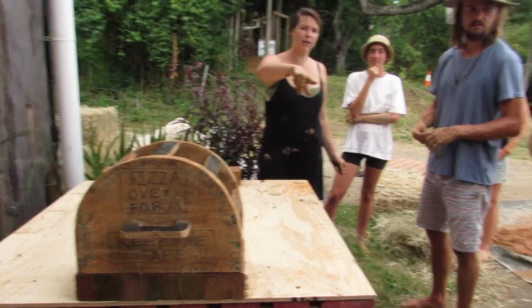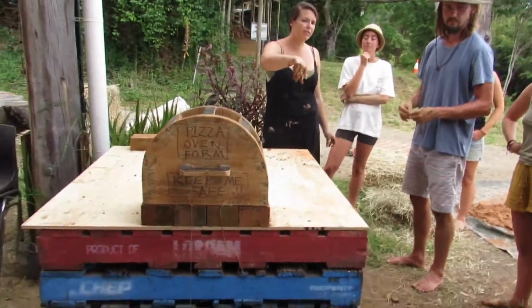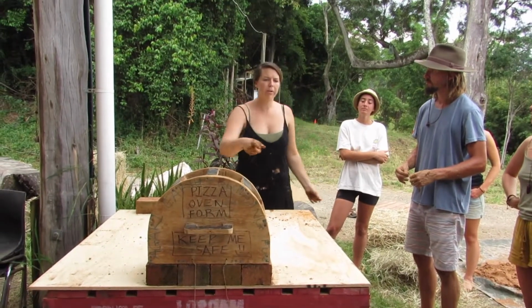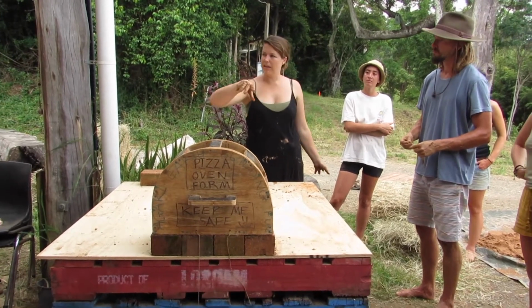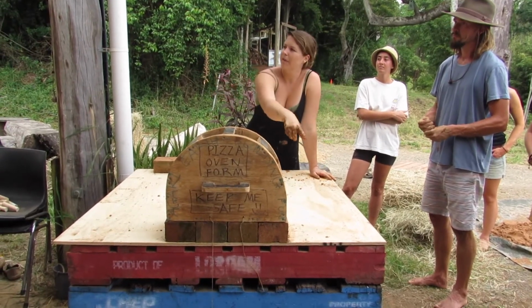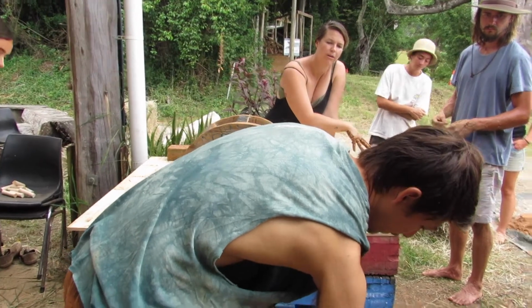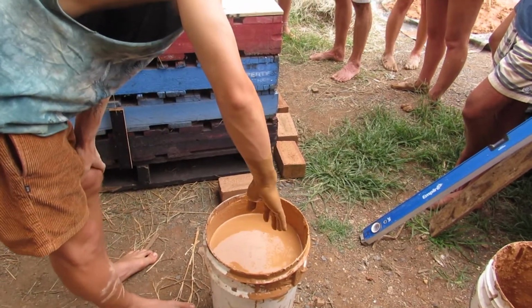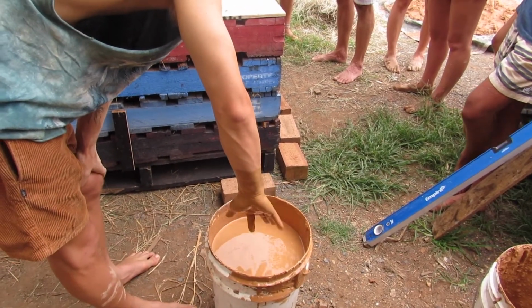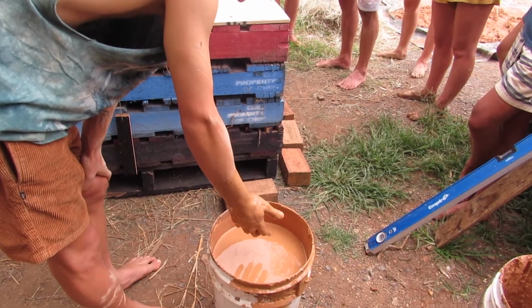That's awesome, Brian. So clay slip, just quickly, you always need this in earth building, no matter what you're doing. You need it in light earth, straw bale, cob, and it's just watered down clay. The way you determine that it's thick enough is if you put your hand in, and pull it out, it should cover your hand like a latex glove. So if it's too watery, you'll see skin through it, and if it's too thick, you'll get webs between your fingers. Does that make sense?